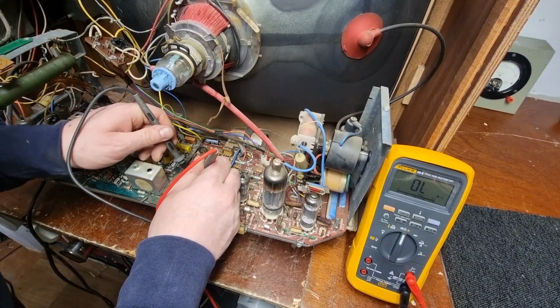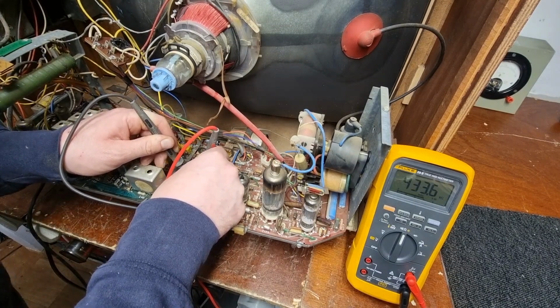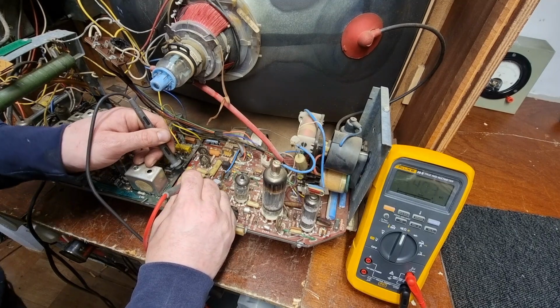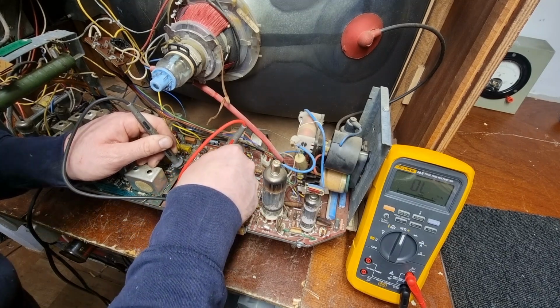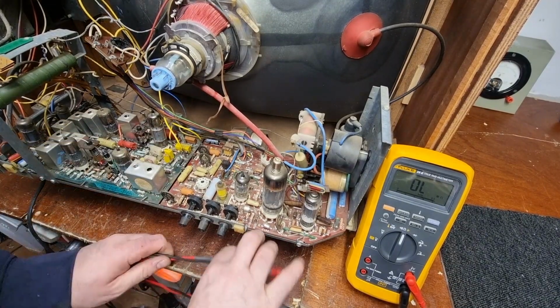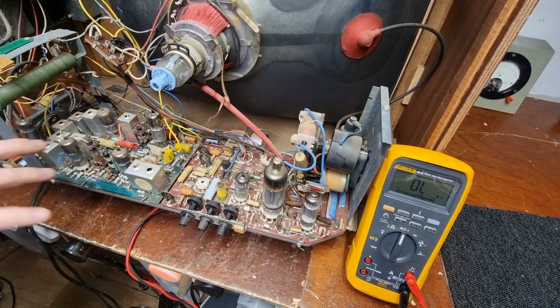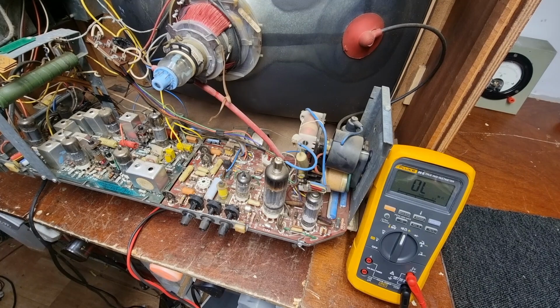Let's see what's going on here. 330k. 433k. Oh, he's risen a bit. What have we got here? That's 4.7, 5.4. That's probably not too bad. Yeah, we could get rid of him. Right, we're going to change this one here for a start. Right. Let me see how we get on then. They're all out a bit, and it could be a cumulative effect. But, you know, it could be as well changing the lot, alright. We'll see how we get on.